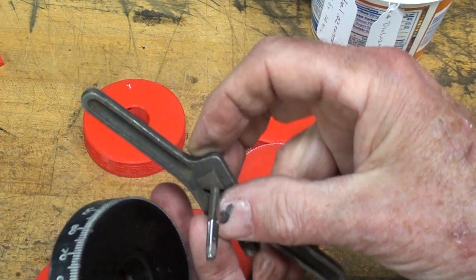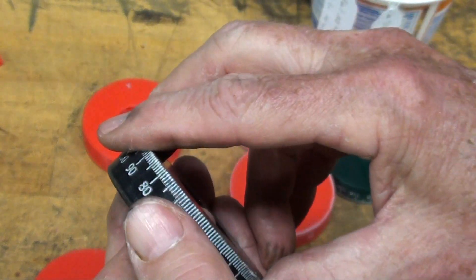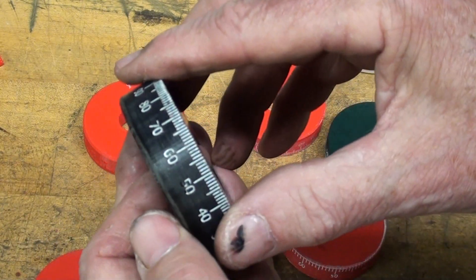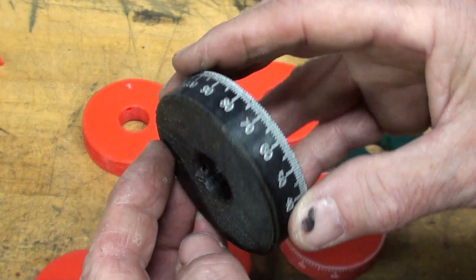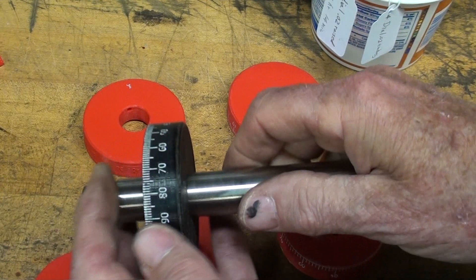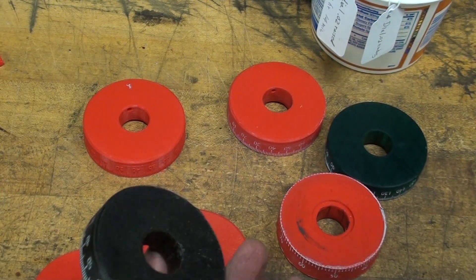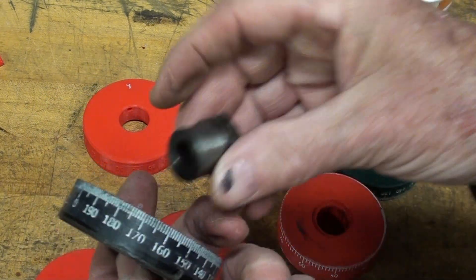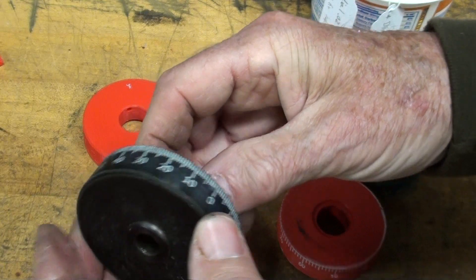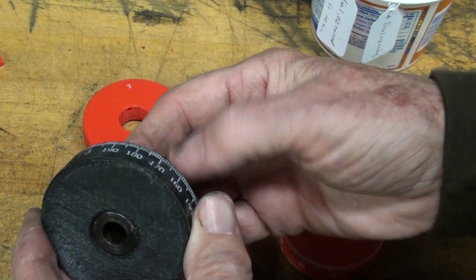I also had to tap the hole. One other thing I had to do was deal with a little bit of what Kevin called elephant footing along the base edge, so I sanded that. I just put it on an arbor in the lathe and ran the sander along that little bit, and it turned out quite nice. It has to spin on there so that I can lock it in place.